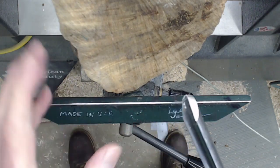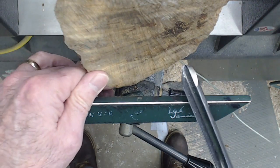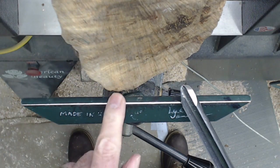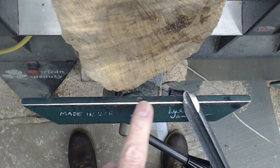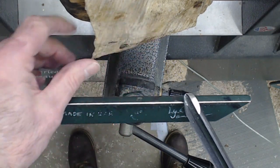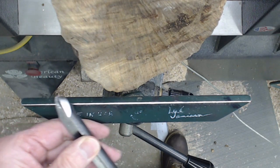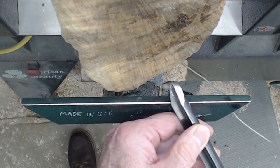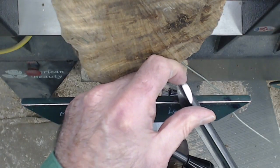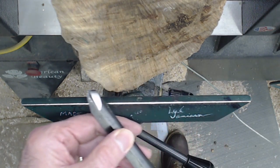Now I have this on with the drive center — very securely held between the tailstock and the headstock drive, very tight, very secure. It's not going to go anywhere; the drive center teeth are biting deep into it. I've got the camera view so you can see I have the high spot here close to the tool rest so I know where the wood is. I've got a lot of wood to take away to get down to the mass of the rest of it. So I'm going to take small cuts across with my bowl gouge, come back, advance a little bit more, come across again. I've got support up close to the wood, and the bevel is going to be there to support it while cutting. The bevel is lined up parallel to the tool rest.